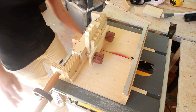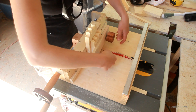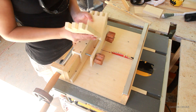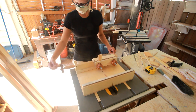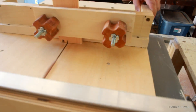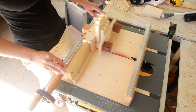This jig is meant to be taken off the crosscut sled. It's pretty easy to remove and put back on again, so you can use the sled to make crosscuts when you're not cutting box joints. Also, these measurements are all based on imperial and very much related to the size of the rod you use. You could certainly do this in metric, however the spinning would be a little different depending on the size of the rod, so you would have to work those numbers out. I just want to say that this jig is really easy for anyone to use — you don't need any technical expertise. So far for me, it's been very safe. However, you should always be careful with your table saw. I really like that you don't need many parts — it's not a complicated build. It's pretty easy and it's very useful.